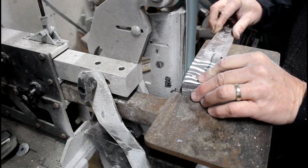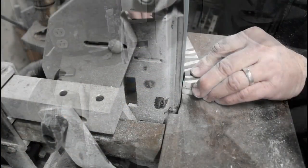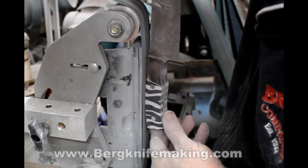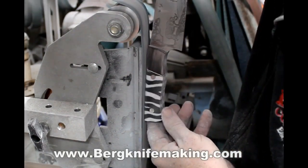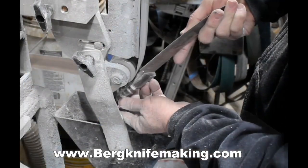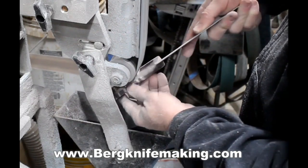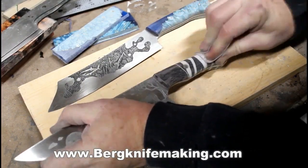I'm going to finish these handles like I do any of my knife handles. I go back to the 2x72 grinder coarse grit belt and profile the scales — I've already glued and pinned them onto the blade. For the inside curves, I let that coarse grit belt overhang the right side of the flat platen so I can get into those curves, and I'll finish those up on a small wheel later. I also use the 2x72 and flat platen to start to round over the top edge of the handles. You definitely don't want to touch that grinding belt to the finished blade. Then I go to an oscillating sander — 220 grit, then 400, 600, then 1000 — and finish it off with hand sanding at 1000 grit.